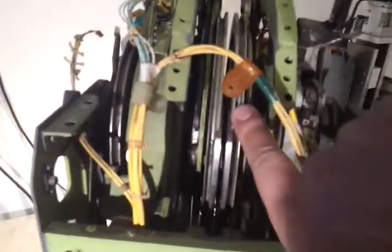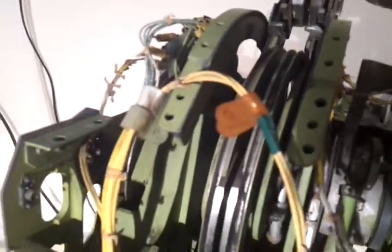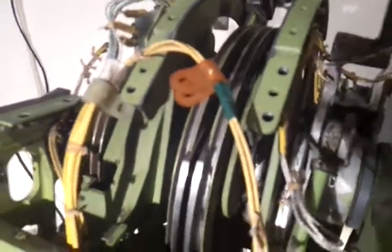Some words about the levers. As you can see here, when I move the levers, the thrust levers just turn this wheel. In the original state, you have some cables running down here, so the movement of the levers is transferred to some steel cables and basically then onwards to some fuel valves, I think. So about the reversers — if you just move the thrust levers, these discs are moved. Now if I put the levers back to idle and then go for the reversers, you can see that the disc is moved in an additional way. So this is basically how the levers work.